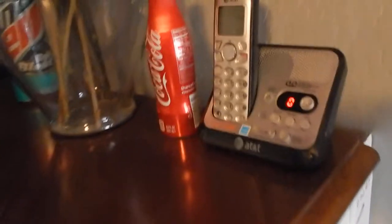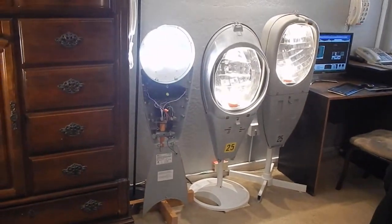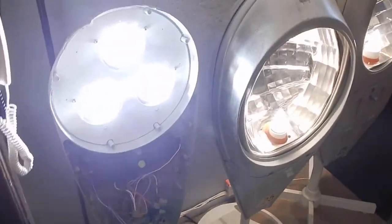If some of your homes have an outlet that's upside down - this one used to be one of those - but there was another wire coming from that outlet to one behind my dresser. What I did is switch a couple wires around to make that one run non-stop and make that one switched. My ceiling fan light is independent from everything else, but when I flip this switch back on - just like that - I don't have to unplug anything. I bypassed all the photocells.